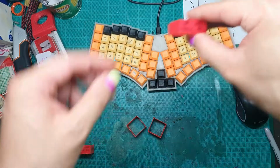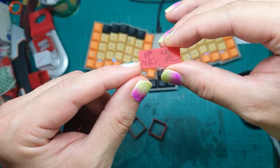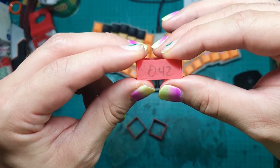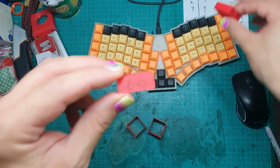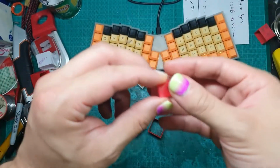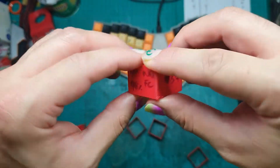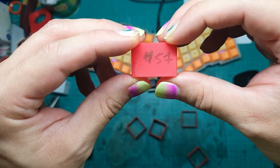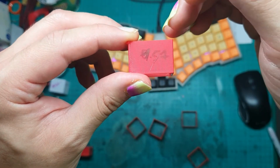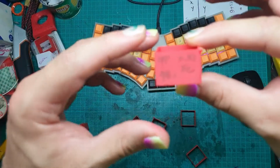So great. Then I wanted to see what happens if I up the extrusion a little bit. 98% with the setting turned off, one wall, and I get 0.42, which is still in tolerance, pretty accurate. And if I do the same thing with two walls, I got 0.7778. So that's even closer, right? And if I do 4 walls now, I get 1.57, right? I should get 1.60, so I'm 0.03 off. So this is really, really accurate. This is within tolerance.